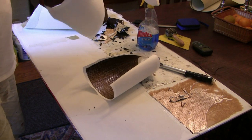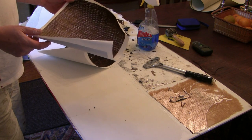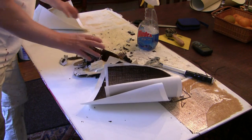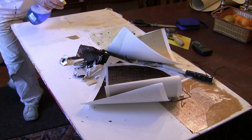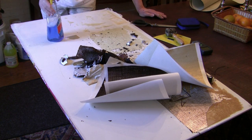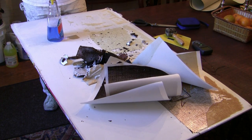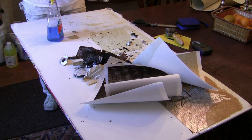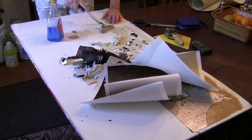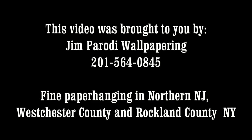There's no doubt in my mind that if you've got one of these metallics, use a liner. By the way, Philip Jeffries makes a metallic linen which I also had difficulty removing — very much like the paper weave. But their Glam Grass was not really bad. I guess what this says is that you can't really know beforehand how something is going to behave in terms of removability, because the Glam Grass kind of surprised me that it came off so easily. The paper backing does come off, and that's not a bad thing to remove.